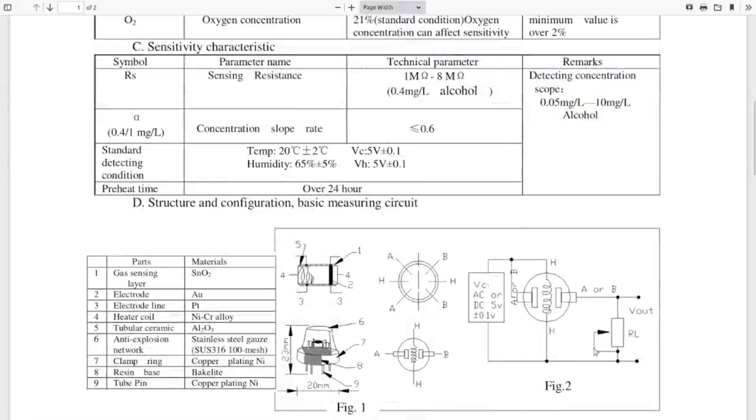And then if you build that into a voltage divider circuit like this, this particular one has a calibration resistor, but that's just a resistor. So that resistor divided by this resistor with the voltage passing through the device will give you your measurement voltage output. And I'm wondering, at that level of resistance, is the input impedance to the Arduino maybe messing with it a little bit? I'm not sure.